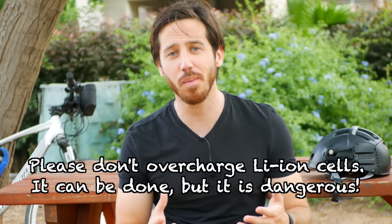If you started at 100% charge and you're regenerative braking, you could actually be charging the battery past 100%. Batteries can be charged past 100% — 4.2 volts is the full voltage level for a lithium-ion battery, and they can actually be charged to 4.3 or 4.4 volts. By 4.5 volts, you're risking explosion and fire, so you really shouldn't charge them past what they're rated for. You're simply drastically cutting the life of the battery. Worst case scenario, your battery explodes. Best case scenario, you're cutting the life of your battery, perhaps by as much as an order of magnitude.